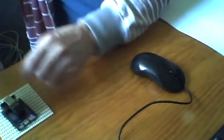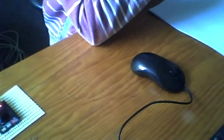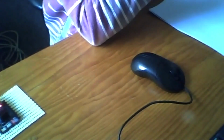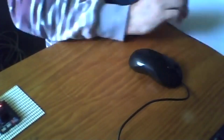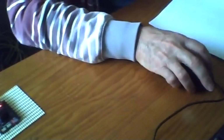Anybody have questions for Ray about the driver or software interface to that display? What pins are you using off the VGA? On the VGA or on the LCD? VGA. VGA, I'm using 20 to 31. Okay. The code for that LCD is up on the thread with the 4-inch LCD, and the code's up there to have a play with. All right.